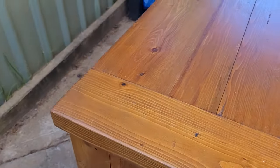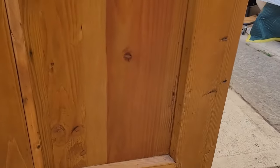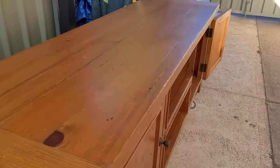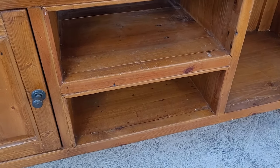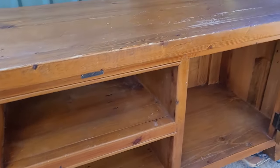This split down the middle — I'm not going to fill it. It's not really going to benefit at all because I'm going to be sanding it, and everything else is all good. So I'm going to get the wood filler on that chip — I'll use Dixie Bell Mud on that. Then take the doors off, take the drawer pulls off and the hinges, and I'll be ready to start sanding tomorrow.